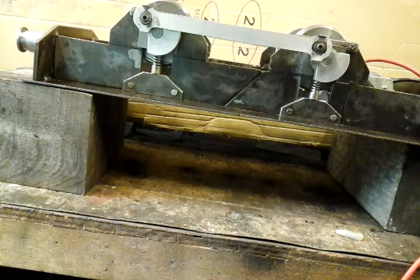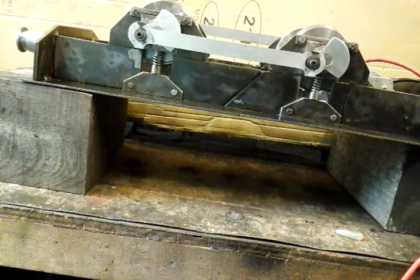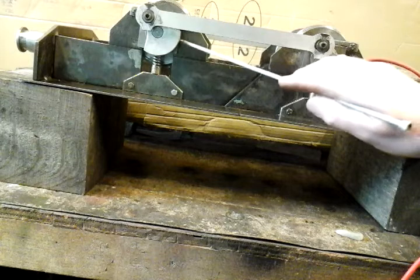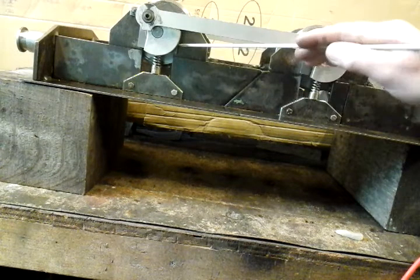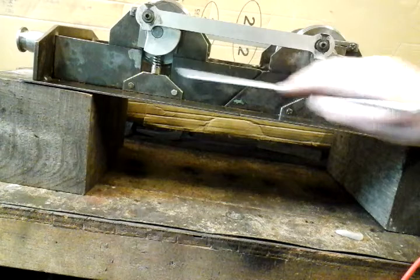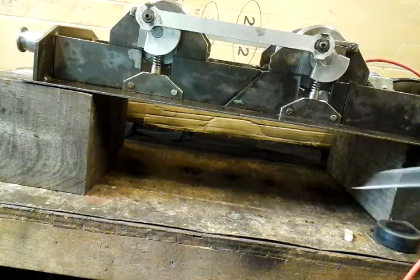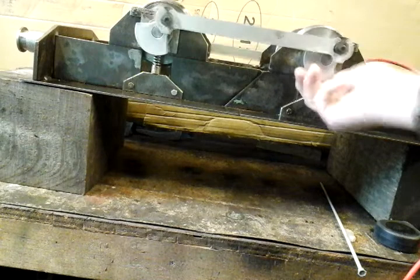I did get a couple of tight spots myself, I'm going to be honest, because I've only fabricated this frame. So what I had to do, just to get the tight spot off, I found out which one was tight, and on the axle box I just had to do a little bit of fine detail with a smooth file — just to take a couple of thou out of the one that slides so it would run freely. That's how I got out of that one. So I'll just pick the camera up now and show you how I fitted these crank arms.